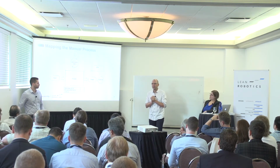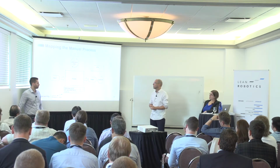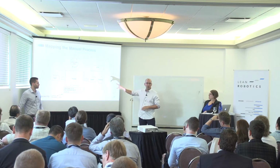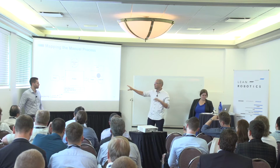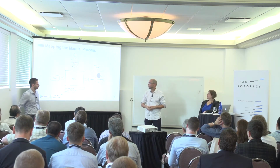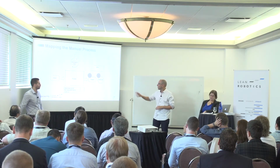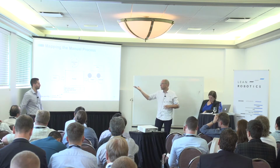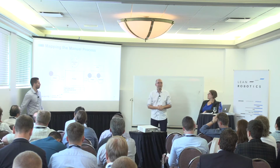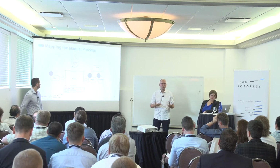So the first step is to get all this information regarding the actual process. Basically, the goal is to get all the information that we call with the customer. Like in lean manufacturing, the customer, in that case, is the next process. And basically, what is the requirement on this customer is going to be the output of our cell. What's all the information? Probably we need pictures, we need information about the minimum, maximum size and weight.